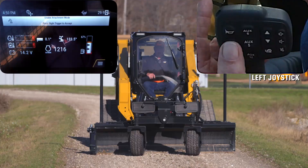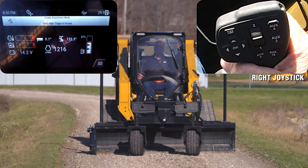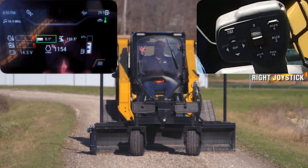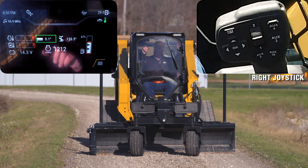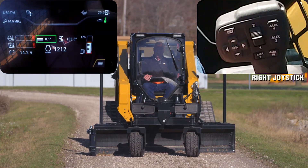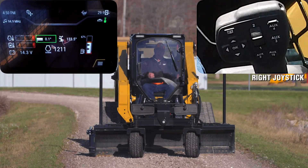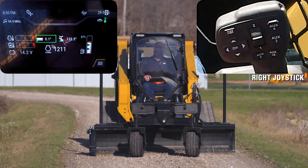When I do that, the next function is going to ask me to go to the right hand joystick trigger and squeeze it one time. You'll notice now that the green box is highlighted, and over here on the right side the shovel is green. That is showing me that the attachment is in attachment mode and assist is going to be on.